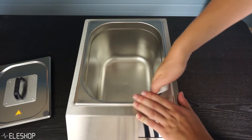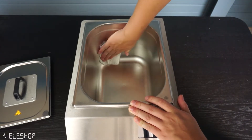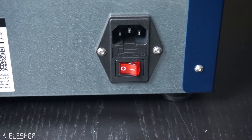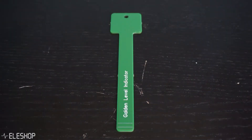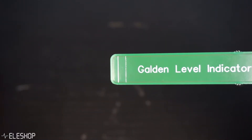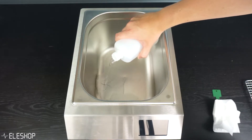Before we can start using the VaporFlow we need to make sure the container is free from dust and clean on the inside to prevent contamination. Afterward, connect the VaporFlow to the mains, but make sure it is turned off before connecting. We can then fill the container with PFPE fluid, using the fluid level gauge — keep adding small amounts of PFPE fluid until the level is between the two indicators on the gauge.